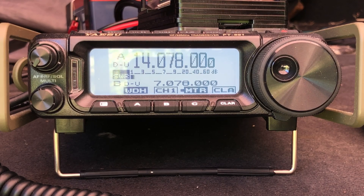On 20 meters, that one's showing a little bit higher — the radio is showing higher than the nano VNA, which was showing less than 2 to 1. So you have to figure out which device you trust the most. But let's assume it is 3 to 1 at worst case — it's still very easy to tune. Honestly, I would run it right here without a tuner; the radio is not complaining about high SWR.